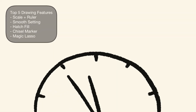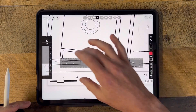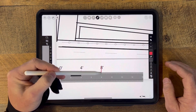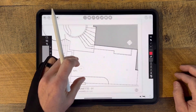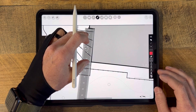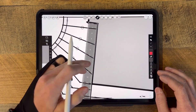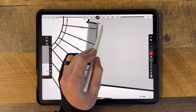So enough with the small talk — fire up your tablets and let's start drawing. The first thing you want to do from a good practice standpoint is to verify the scale on any drawing that has a preset scale. In this case, one inch equals four feet and two inches equals eight foot. If you don't have a preset scale, you can always pull a field measurement, or if there's an existing dimensional callout on the plan, you can set the scale within the app. This in itself is a very handy feature that Trace offers.